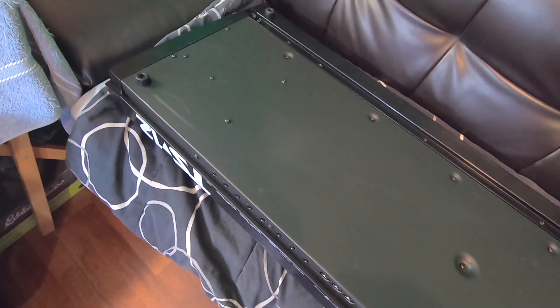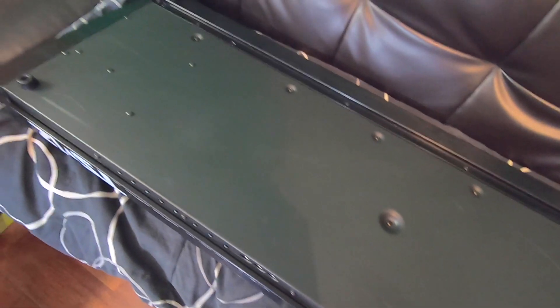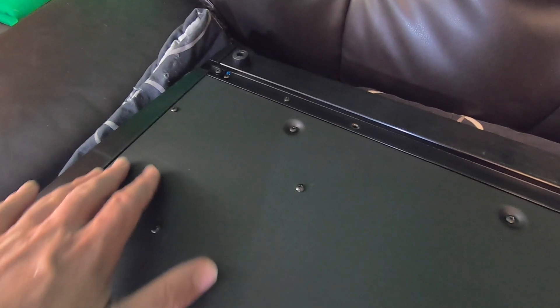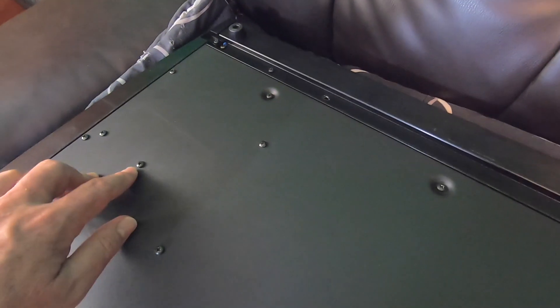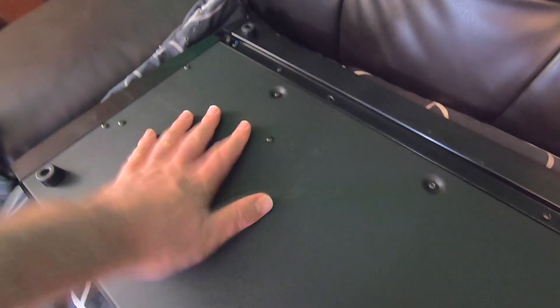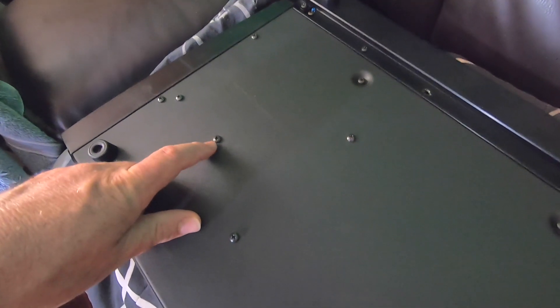Subscribers, I hate that you've seen this a million times, but for people watching for the first time: to take the cover off of this TS, you have to take pretty much every screw out except for the keybed screws. You have screws back here, all of these screws through here, and these need to come out. Some of these are coarse thread and some are fine thread, so pay attention to the order and pattern you take them out in. These go into plastic and they're coarse thread, so if you mix them up, when you put a coarse thread back where a fine thread should go, you're going to screw it up.